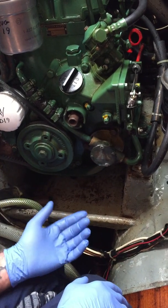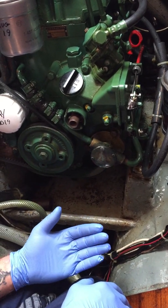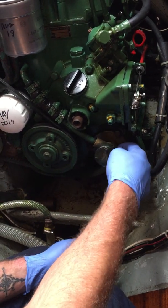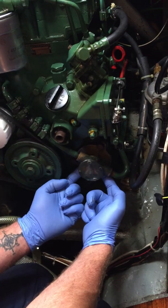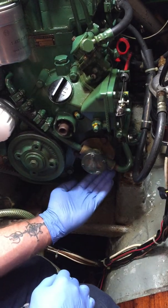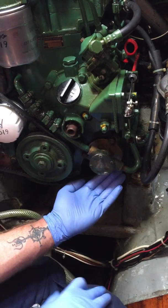Is that something that could wear? It's common - mostly the water seal goes first. And this gap that you can see in the top of the pump goes all the way around. So if either the oil seal or the water seal were to leak, you would see evident water or oil dripping from the bottom.